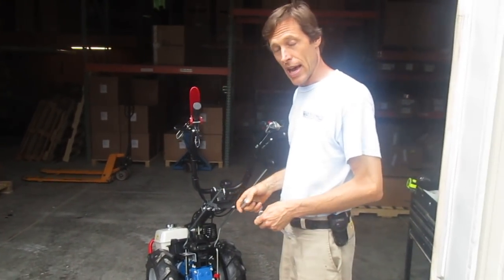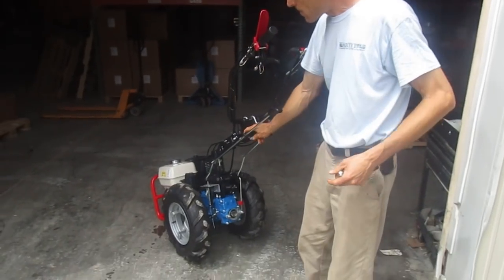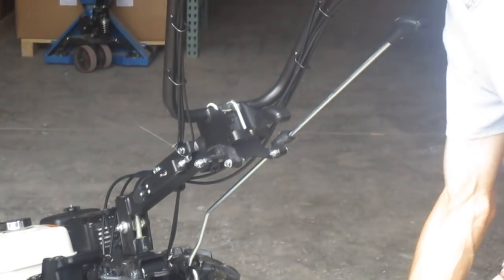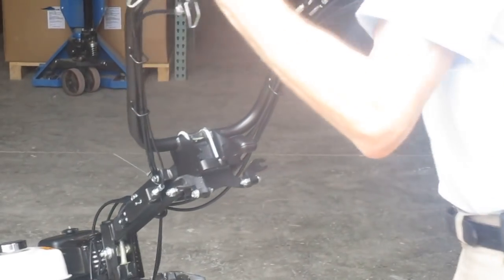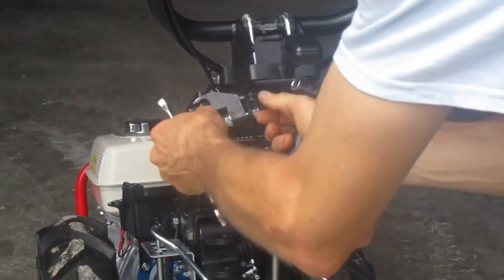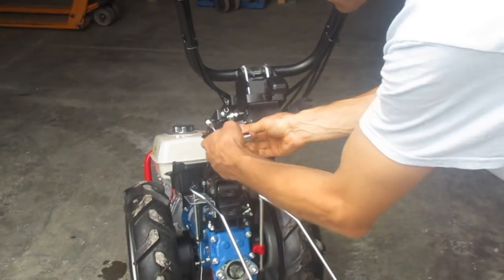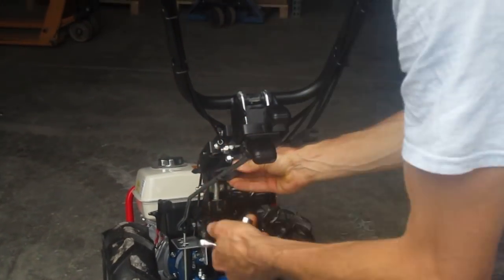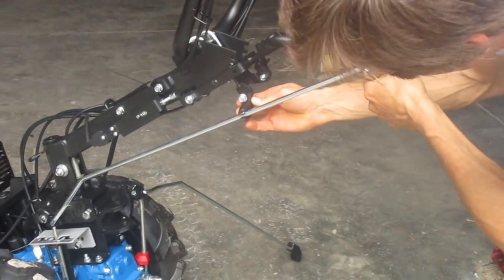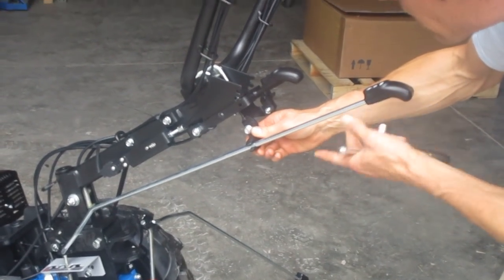One thing you've always been able to do on a BCS up until relatively recently is angle these things a little bit by twisting this mount on the bolt. By twisting it, you could sort of change the angle at which the rod lays through this thing — looking at it from the side, you could twist it a little forward or backward — and that actually had the effect of shrinking the slot size, so it tightened it up and kept the lever from jumping out.